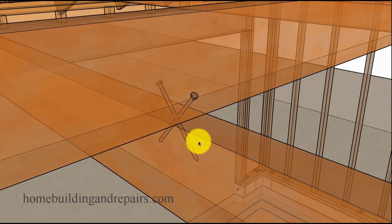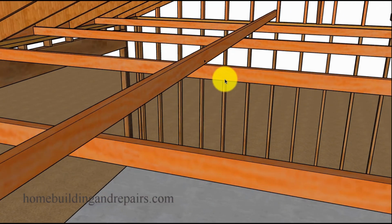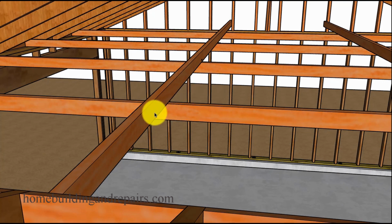And I'm not saying that the rafter ties can't separate from the strongbacks. Not saying that at all. I've seen them separate too many times, but this method right here, kind of creating a crisscross, does create a nice connection. And again, I've worked on a lot of houses that have had situations exactly like this, and you'll see one of the rafter ties is separated about a 1/2 inch or something from the collar tie, and the one next to it is still tight.